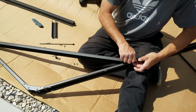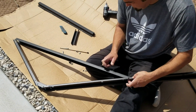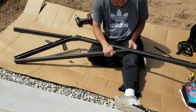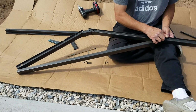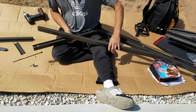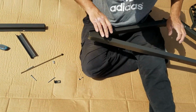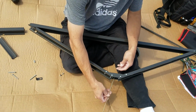It's already pre-made. You see it laying there on the cardboard. I usually run one of those through after I put these small screws in the end, just like the other trusses, from the inside out. You'll be coming back later and tightening these all later. Those you don't have to worry about crimping, but the ones on the top there that just slid across the top part of where the roof is going to be, you don't want to over tighten those at all. Just snug them up, because see that channel there, the roof pieces are going to sit in that channel.